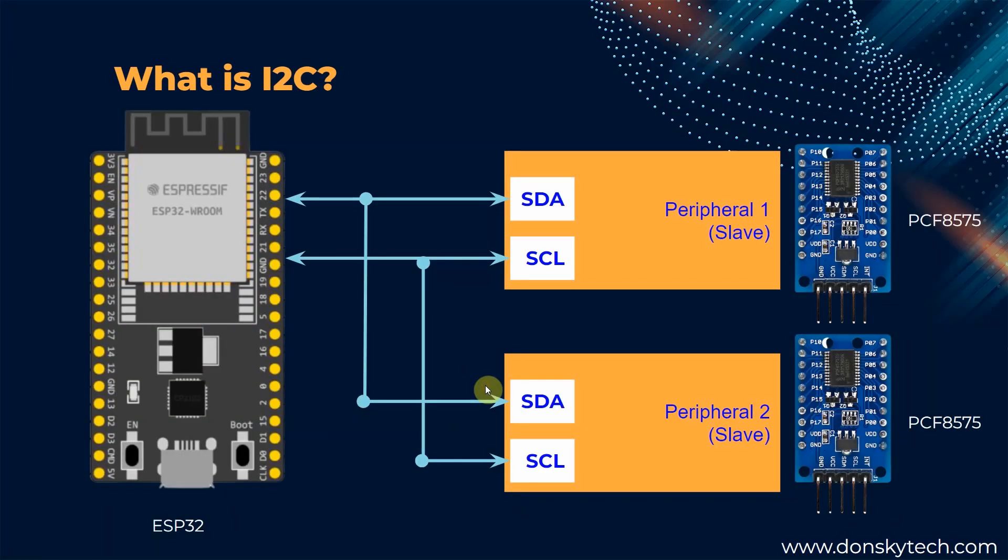So, what is I2C and how can it help me? The reason that I2C is really a good protocol is that by just using these two I2C bus lines, which are SDA and SCL, then we can connect multiple PCF8575. For example, the first PCF8575 may be directly connected with the SDA and SCL pins, and in parallel we can have another PCF8575 connected also to the same serial bus. The only thing that you need to remember is that each of your PCF8575 should have a unique I2C address by soldering the back side of this module.